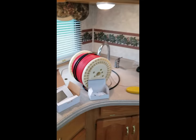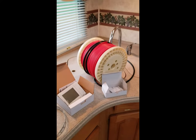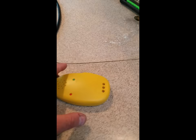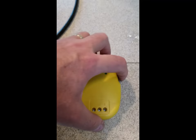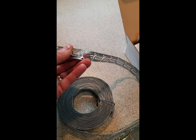This kit is 120 volts, 12 amps. I bought it on eBay for $220. It comes with 360 feet of wire, a thermostat, and also a little unit that you hook up while installing the wire — it'll tell you if there's a dead short or an open circuit and give you an alarm. It also comes with some clips that you screw, attach, or staple to the floor, then lay the heated wire inside at approximately 3-inch spacing.